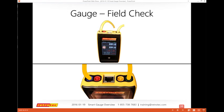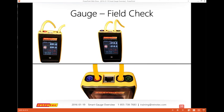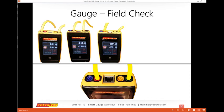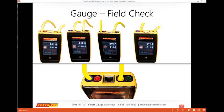So basically what you're going to do is check the input on both channel A and channel B. You'll check the reference on channel A and channel B. And notice that the numbers are usually around 200, maybe 270, 260, somewhere in that range. That pressure is created when the yellow tube is put on those ports, and creates a small pressure. You're going to enter those numbers in that sheet that I had a second ago, and it tells you if you're passing. Basically what you're after is, are these within, in theory, 1% of each other, and the sheet actually calculates it for you automatically.